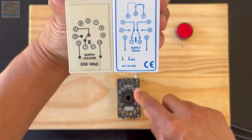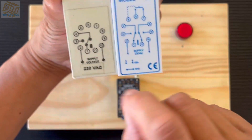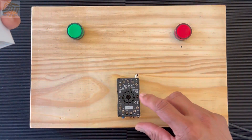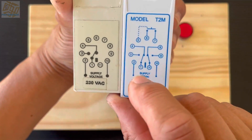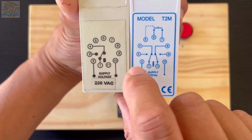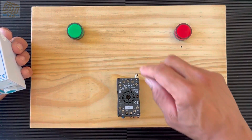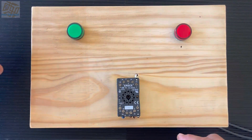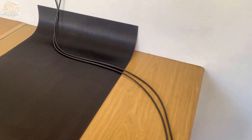On the rig I have used contact point number 4 as a load — on both timers contact 4 would be the red light as a load. I have also used contact 3, which is part of my normally open, and connected a load light to that point on the base as well — that would be my green light. They both share a neutral, and pin 1 is the common. The coil is supplied by a different supply.